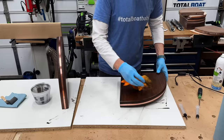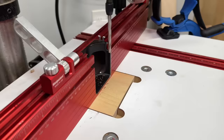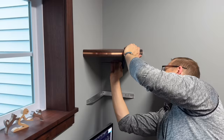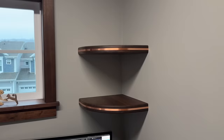And there they are. Still not over the moon with how they look, but I'm over it. To secure these shelves to the one-by-one aluminum channel, I'm installing some quarter-inch-long, quarter-20 set screws underneath. This should be more than sufficient holding power to make sure those shelves don't slide around — especially when Jerry and Lola decide to jump up there and make it their napping place. Once those were dry enough, it was time to get these hung up on the wall and in the rear view mirror.